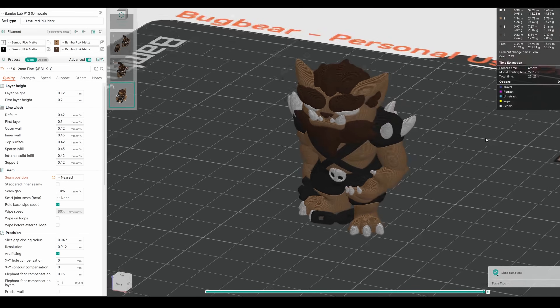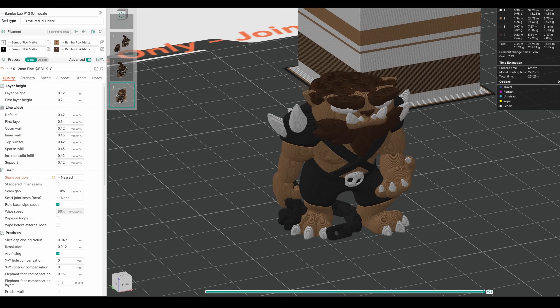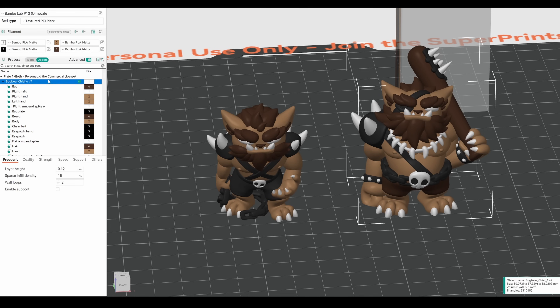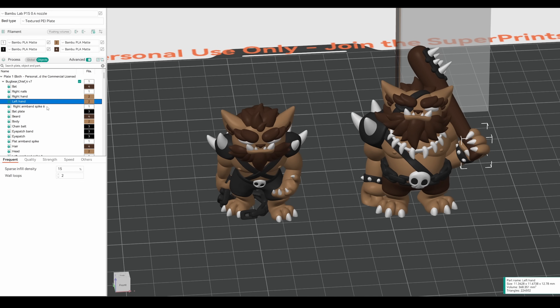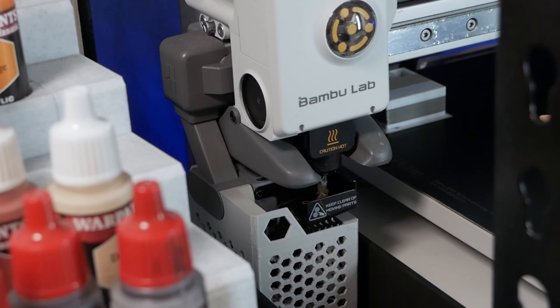Opening these up in OrcaSlicer we can see that these models have been designed from start to finish with FDM in mind — large details that can be printed with a 0.4mm nozzle at slightly thicker layer heights, with no supports required and preloaded with multicolour painting. Now it's well known that most FDM multicolour printing results in a lot of wasted material — purge material that is spat out with each colour change to make sure there is no contamination or bleeding between colours. As such, SuperPrints recommends printing as many copies of a model at once as you can, as even with 8–10 models on a plate you're likely still only seeing a 1-to-1 ratio of actual print versus the waste it produces.